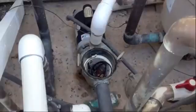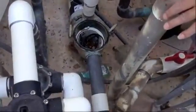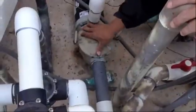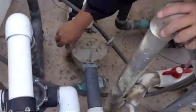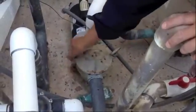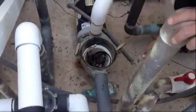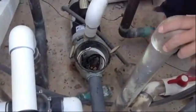What we're going to do is pull back on the wire because we're going to cut that pipe and we have a manifold. We know that we don't have a leak above ground on that manifold, so we're going to pull the wire back and leave the cover off so that we know we don't cut the wire when we cut the manifold. Then we'll start doing our slide mic test.